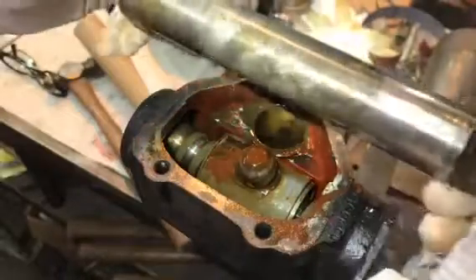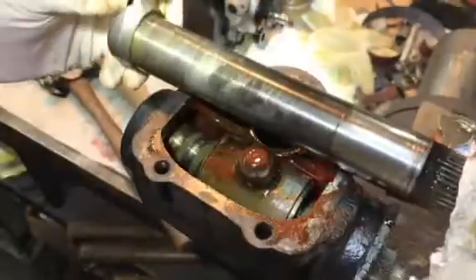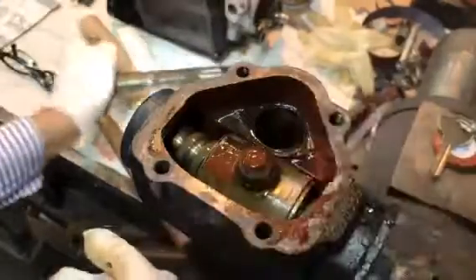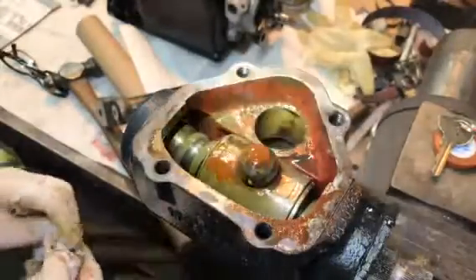I'm going to get this cleaned off. I'm going to get the micrometers out and measure to see how much this is worn. I have to get in here and clean the bushings, clean up the case, see what we got in the way of wear inside here. I have no idea why it was so stiff coming out. Ordinarily when they get worn out, they get loose. This thing was really stiff for some odd reason.